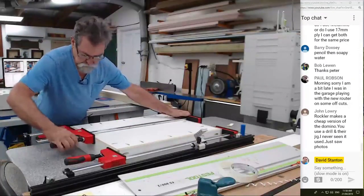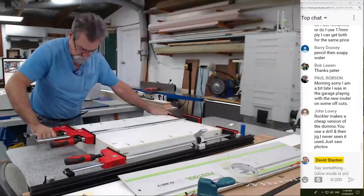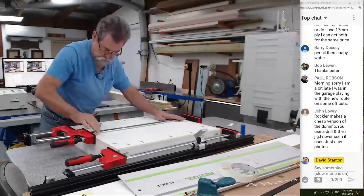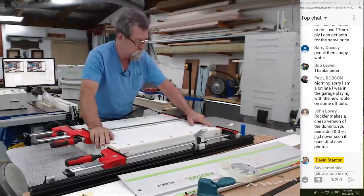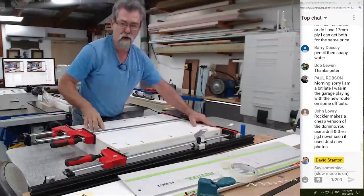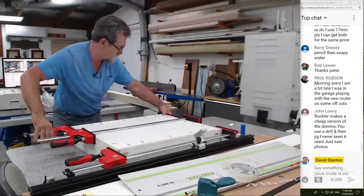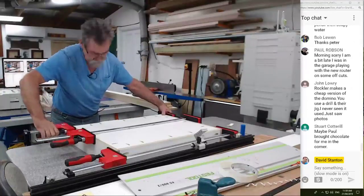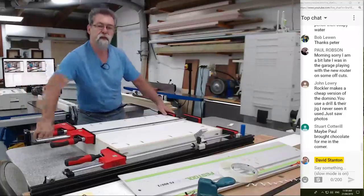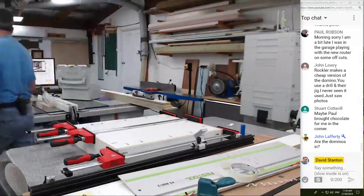Now I'm going to tighten that one up with a bit of force. And then this one. And then this one. Beautiful. Now, some people have asked, when you're doing pocket holes, how do you clamp them so it doesn't slip? This way is great. I've got a truckload of pressure on there now. And that will definitely not slip. I'll back that one off, as a matter of fact, because it's gone down the side. I'm going to raise this one up a little bit because it has nothing to counter the force. I've got to make sure that that's perfectly in line there, of the clamp being around the edge. See, there is no front on this at the moment. You follow? Pocket hole screws, I should say.